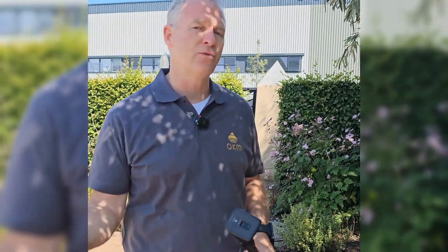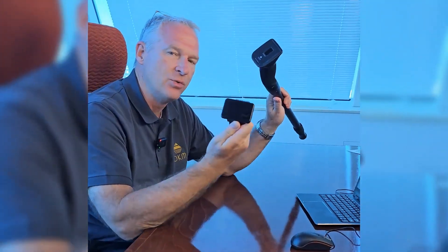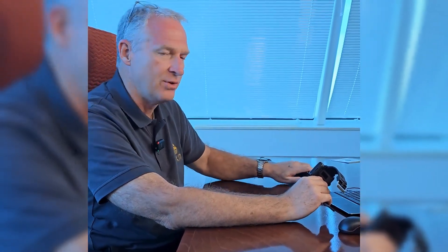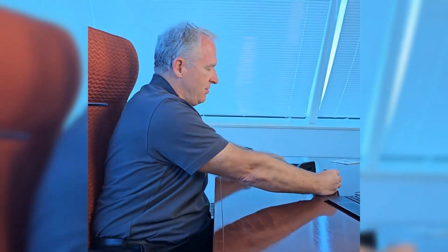And then we're going to show you the pictures of what it looks like out of the ground. Mark here. I want to cover a tip today on using your Rover UC and transferring your data. With the Rover UC, you have a smartwatch that contains the app, and when you're operating the Rover UC, you're doing it with the smartwatch. When you want to do your data transfer, it's the smartwatch to the laptop — not the Rover UC to the laptop. That's really important to understand whenever you're using your system for the first time. The device is paired with the smartwatch, and the smartwatch is paired with the laptop. If you try to pair the device with the laptop, you're not going to get the results you're looking for. So it's always important to remember that the smartwatch is always between the laptop and the device.